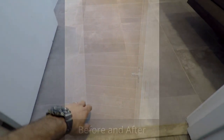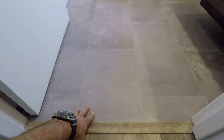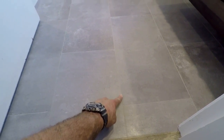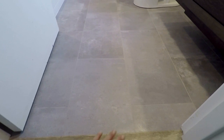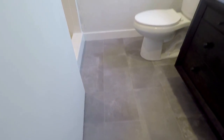We'll start with the floor — it's the same floor as in episode one: a 12-inch by 24-inch rectified porcelain. Being rectified allows us to achieve a true 1/16-inch grout line. The floor is staggered at 50% and is absolutely flat, using the Raimondi tile leveling clips and system.